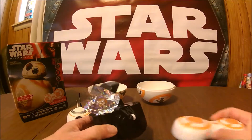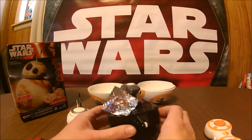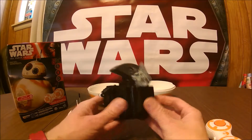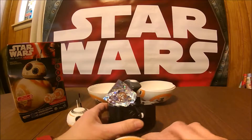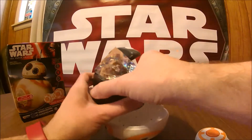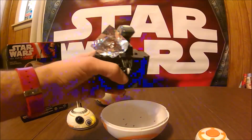Now by soldering to a drive wheel — the way he drives it, it sends power to a wheel when he goes forward, but to make him go backward it reverses the polarity to send the wheel the other way. So the lights only work — since I've got it attached to one wheel — when he's going in one direction. When he moves that way, the lights light up. What I'm probably going to do is add a second LED to the other wheel to give him lights going in both directions.